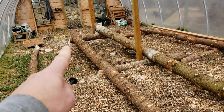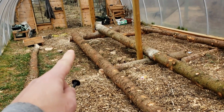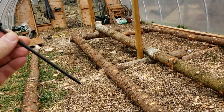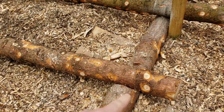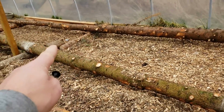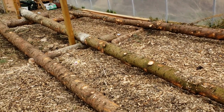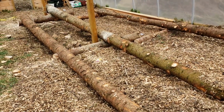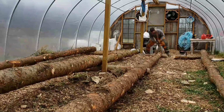That one I'm not worried about. It is so heavy and solid that I just am not worried about that one. And plus I don't think the 6-inch will be big enough to go through that anyway. So we'll put one here and one here, make sure we tie these in real good. And then same on the other side, I'll do one there and one on the middle. And then the top row will just focus on those saddle cuts, making those nicer so it locks together, and we don't need any more lag screws for that.